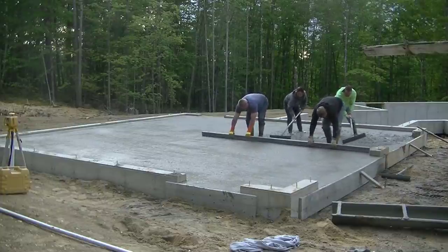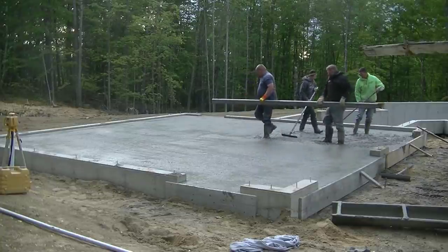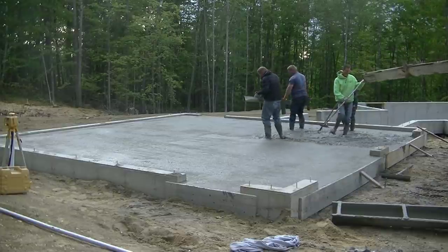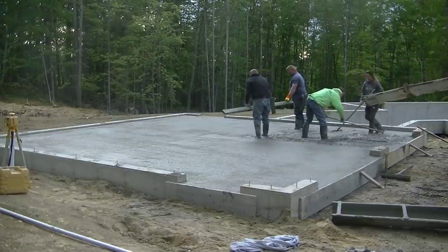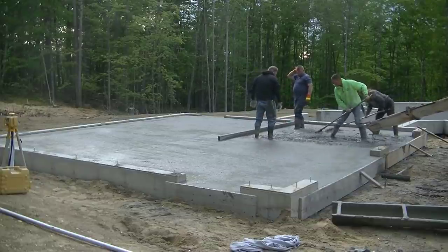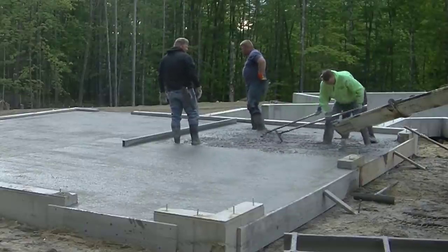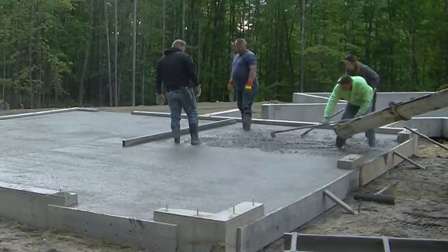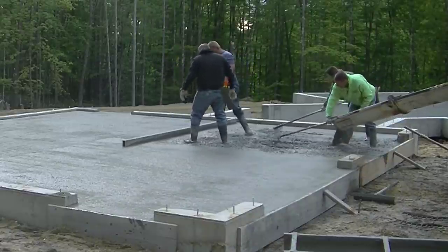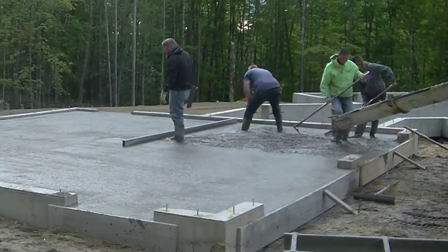The garage floor slopes a little bit towards the front, and even with a pretty loose slump, the concrete doesn't sag. When it only slopes two inches it could slope three or four inches to the front and still wouldn't sag — there's too much area for it to sag. If you get into a lot of slope with a slump like this it would sag, so you'd want to pour it a little drier. When those guys screed, they like to leave it just a little high behind the screed — every time they pull it back they pull a little bit, and that's what makes the floor nice and flat.